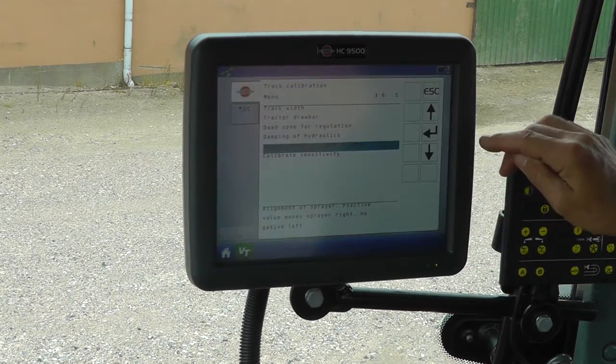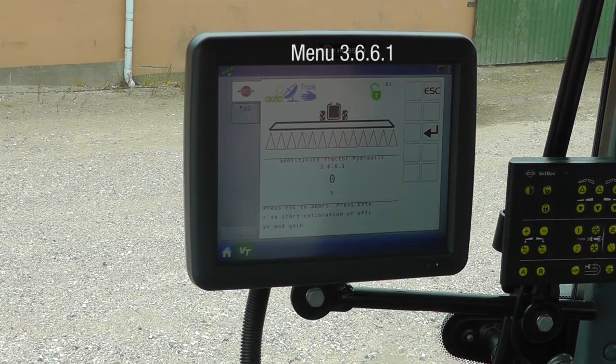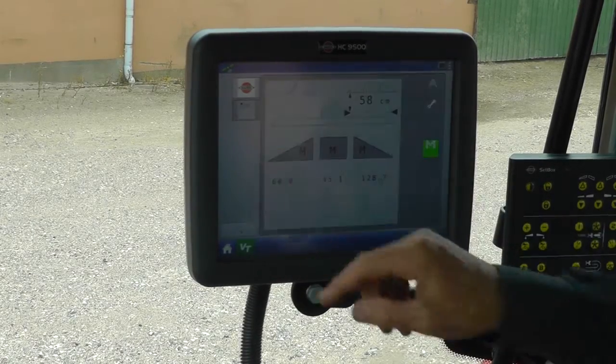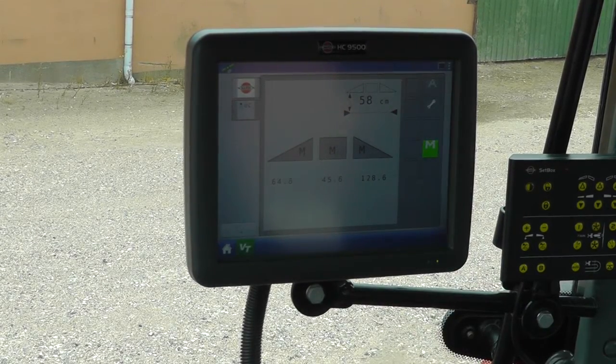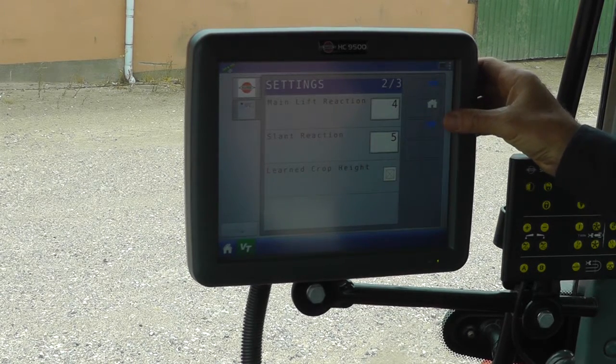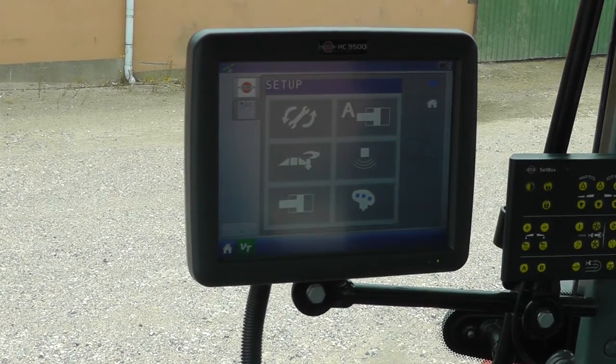Finally, I have the sensitivity test. And here I need to start the tractor and run through the information on the menu to do this. This is best done in the field itself. The same goes for the boom management system. Do the calibration on bare ground. Open the menu. Choose the retune symbol and follow the on-screen instructions.